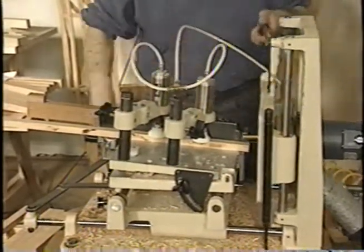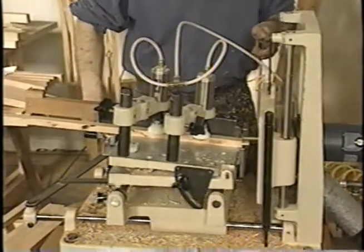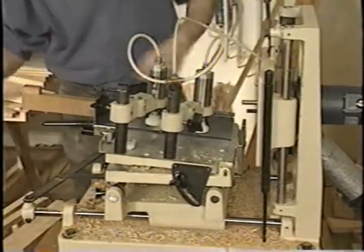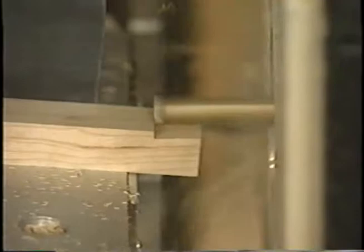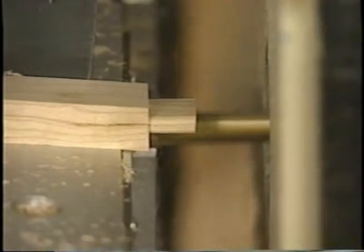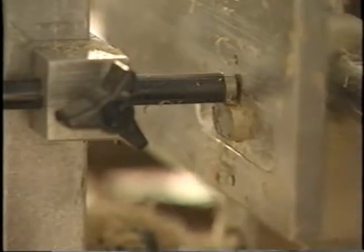Usually, I have to make a lot of tenons in a hurry because I'm trying to earn my living at this. Here's something that helps me: a special tenoning machine that uses a router to do the cutting. It's amazingly fast with these little tenons, and not bad even on the big ones. For these few slats, I've scribed a mark for the tenon shoulder rather than setting up a stop. The machine comes with a whole bunch of different tenon patterns, and you can easily make others. A stylus follows the pattern to trace the size and shape of the tenon.